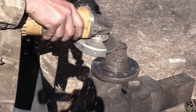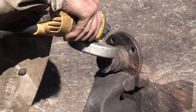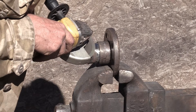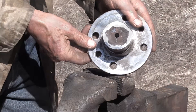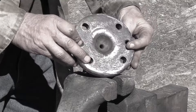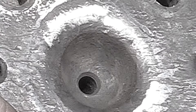For the rough part, I'm going to take care of that with this sander — I've got about 30 grit in there. Just take all the obvious high spots off so the machinist won't have such a hard time getting started on it. Get it basically smooth. A couple of them were worn down a little at the end, so I just made sure I got the corner edge built up enough. A final thing to clean up is welding splatter down in these holes — I used a drill bit that was a snug fit and ran it in and out by hand. The two threaded holes were pretty cruddy, so I chased them with a tap, and also chased the grease fitting hole with an eighth-inch pipe thread tap. There was some dried grease so I ran a drill bit down in there and cleaned it all out.